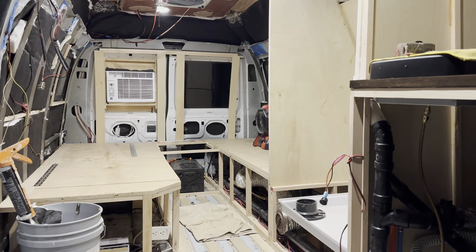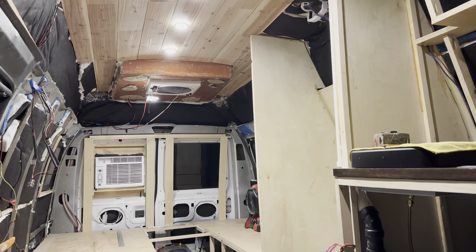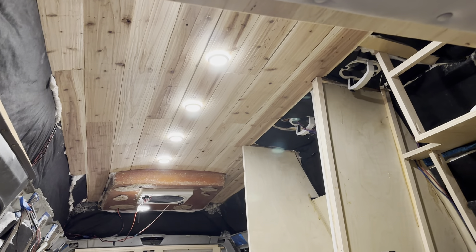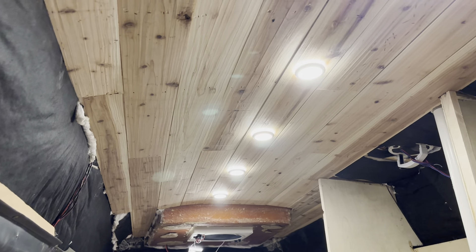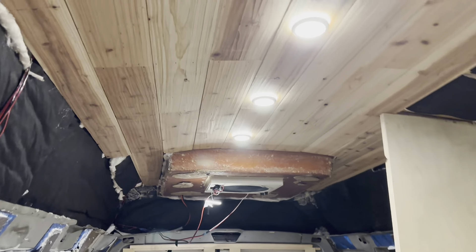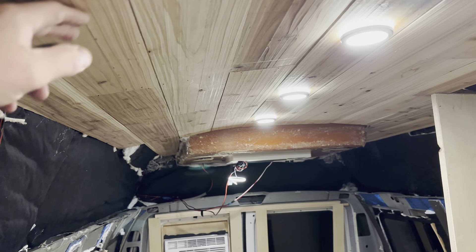The front faces for the bed and seating platform area, all the cabinetry around here, and the bathroom — so the cedar planking is going to be a significant theme in here, and this is a little sneak peek of what it will look like. I'm quite pleased. What we have here is cedar planking made from fence pickets, planed down half an inch. I'll do a little finishing sanding but for the most part I want to leave this planking in its natural state.